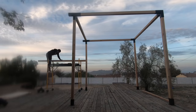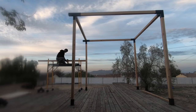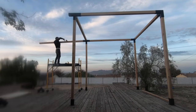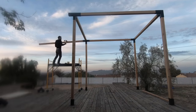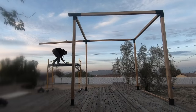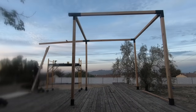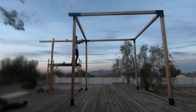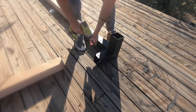Adding the second bay really showed off how strong these brackets are. I was able to insert the first 4x4 and it didn't bend the bracket at all, even when it was cantilevered about 10 feet. I then used my 10-foot temporary support 4x4 to get that 4x4 up nice and level and drove in additional screws.